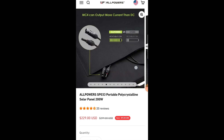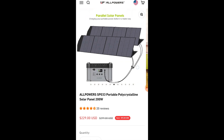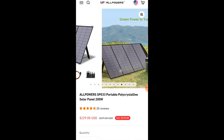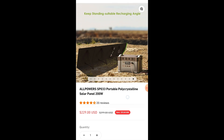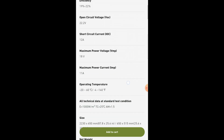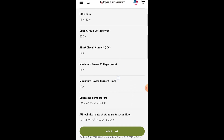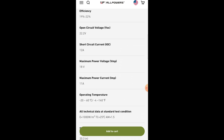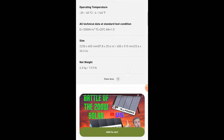It is a polycrystalline panel, and you can wire them up either in series or parallel. The maximum power voltage at 18 volts is an important one — most 12-volt panels made for 12-volt systems have an open circuit voltage in the low 20s, with a power point voltage usually around 18 volts. It might be 17.5 or 18.5, but they're semi-compatible. So if you have a caravan or car with existing roof solar running through a solar regulator, you can plug this in and it should be pretty compatible.